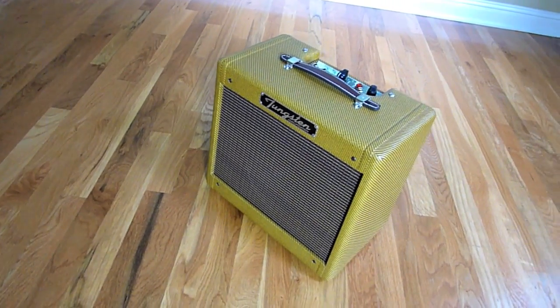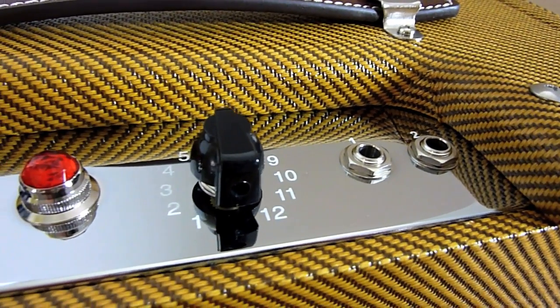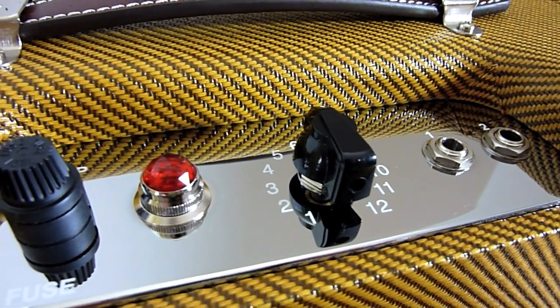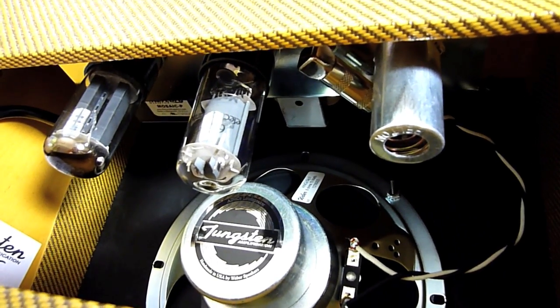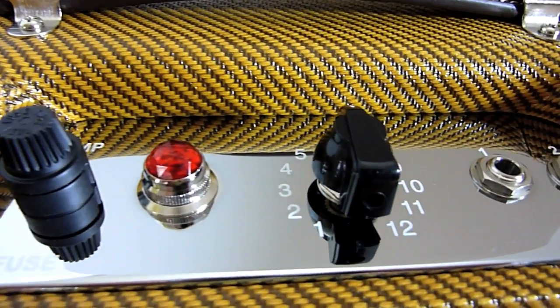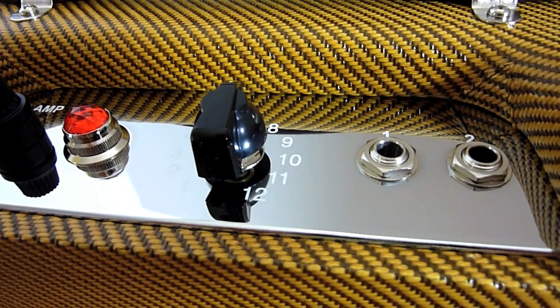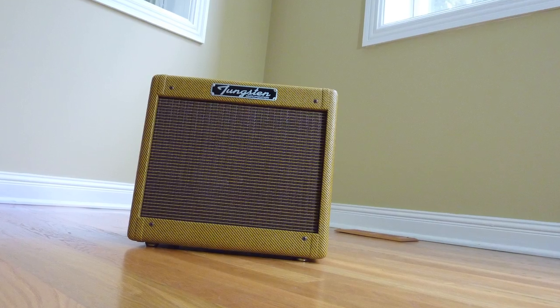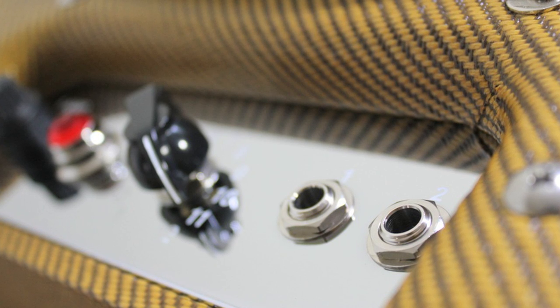delivers many classic tones. The amp features one channel, two inputs, with a single volume control and comes standard with either a 12-inch or 8-inch Weber speaker as this demo showcases. Also included is a Mercury Magnetics custom-wound oversized output transformer, G10 fiberglass eyelet board, Mallory 150 capacitors, Sprague Atom electrolytics, Switchcraft jacks, and a 16-gauge triple chrome plated chassis.